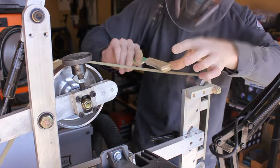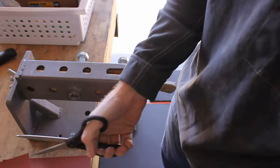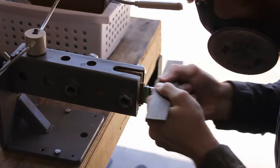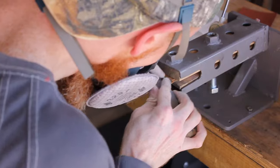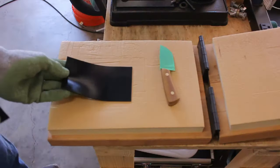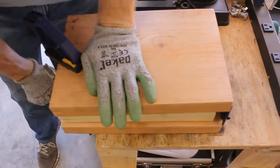And then I have a scalloped 1 inch by 72 belt there, and those things are badass. They'll get you 80% of the way there on your handles. And then we move on to the hand sanding. I hand sand this handle to a 320 grit finish, making sure to smooth it all out. Afterwards, we go ahead and make a little Kydex sheath here.